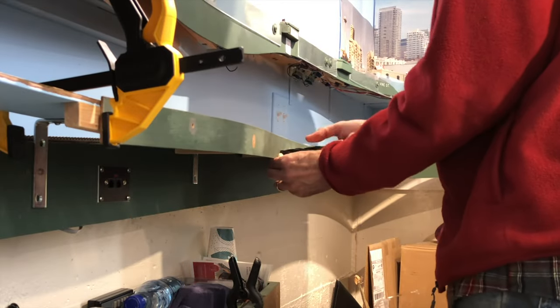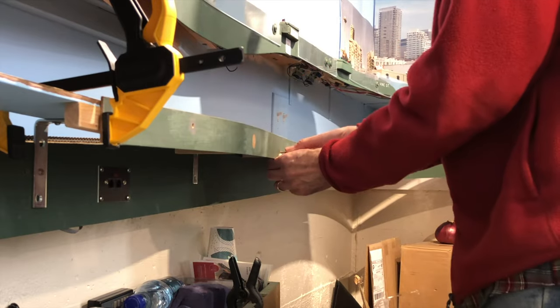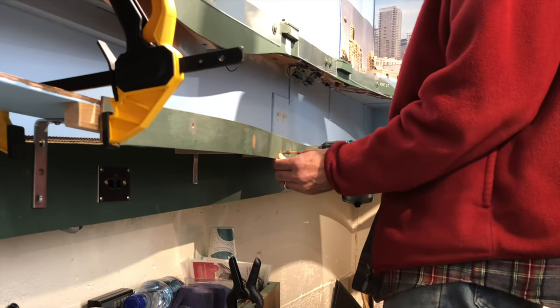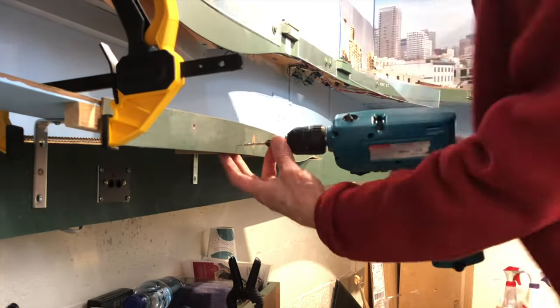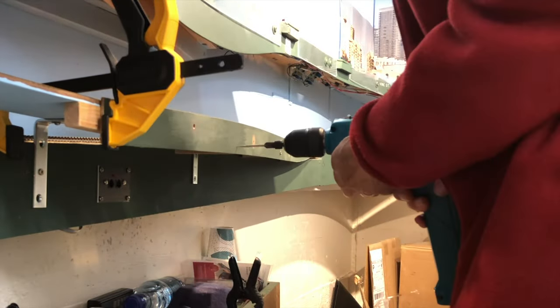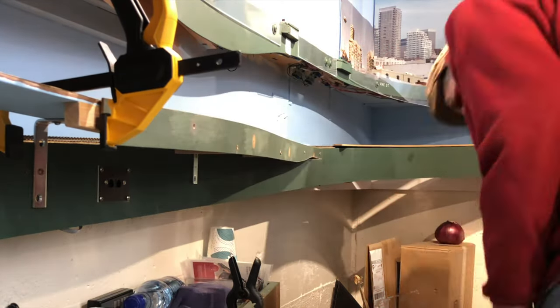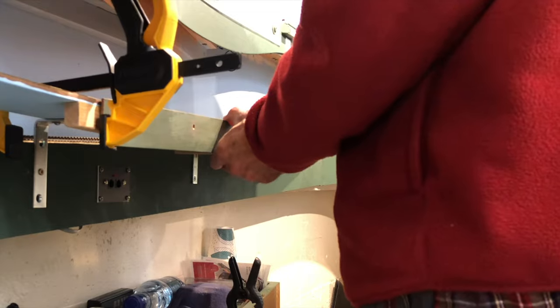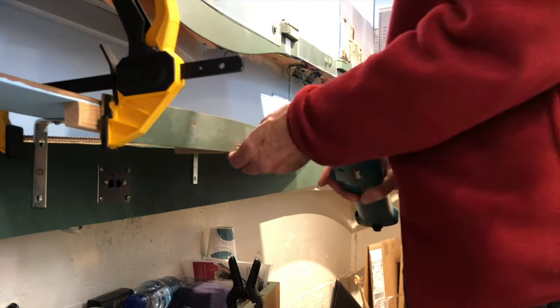And there's my big drill. And I make the countersink and then put in the screw, and hopefully it gets pretty close to flush with the edge of the fascia. This is 1/8-inch masonite that I'm using, very common for this. Now you see I'm drilling the pilot hole in the wood behind the fascia. There I'm drilling out the countersink again, screwing it in.